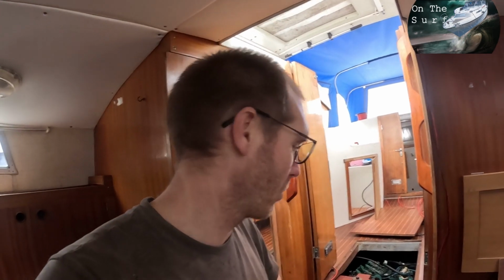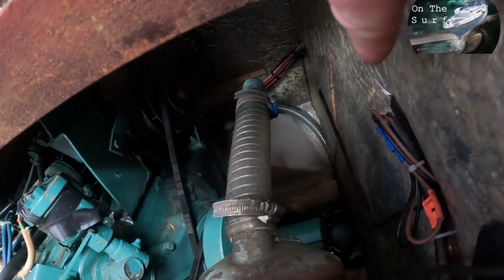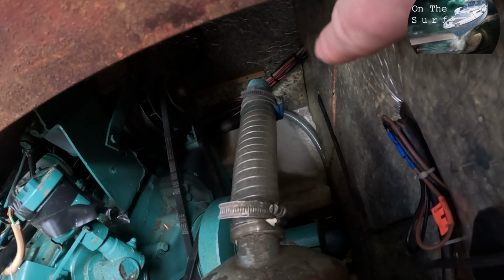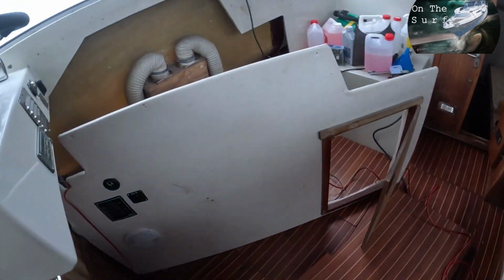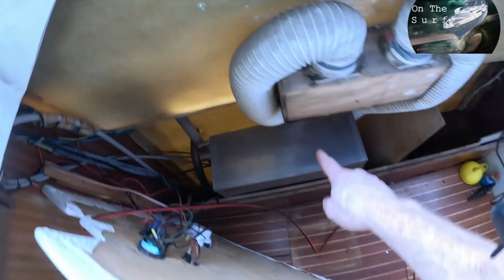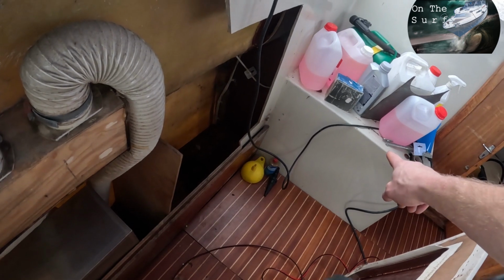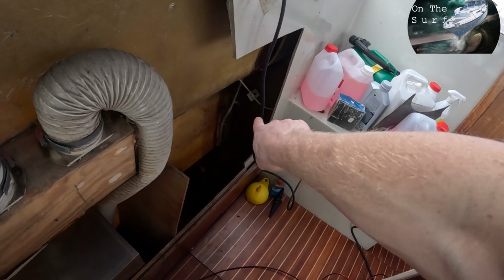Yeah, so now I think I have found the way for the cable. I don't know if you can see it. There's a hole. There is the MPPT. It's gonna come out. Where is it? There. I'm gonna run it here, all the way down there. Then it's gonna come up down there, hopefully, somewhere. Then run it here and over there. The water boiler is actually underneath that seat. So that white wire you can see there, that's the old 230 volt shore power cable.